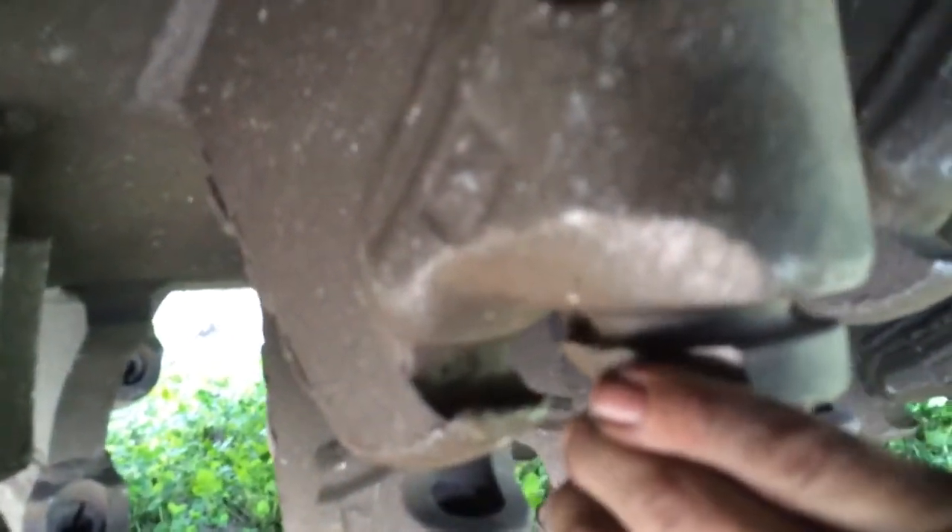You can see it starts to wear the bottom of the base out. These paddles had these blocks on them. You can kind of still see these grooves where the blocks were in the ground. You can see how it's rounded right here — these were supposed to be flat at one point, now they're not. So I'll probably have to weld on it, build this side up flat, grind it down, and then put some hard face on it to help with the wear.